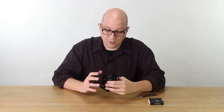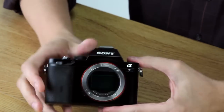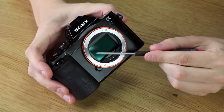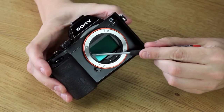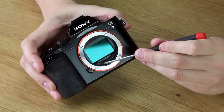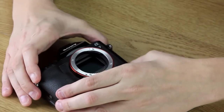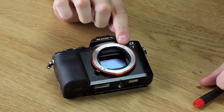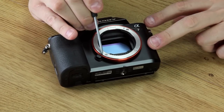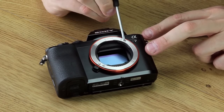So let's pull the lens right off, like so. And if you look inside, you'll actually see these black protrusions. This is what the lens locks into. They're plastic and if you've used the camera just a few times you're going to see wear in those areas already. First of all, note where the white dot is — it's at about one o'clock. Also note there's a little springy button right here. You want to be careful of it while you do the mod. But here are the four screws: one, two, three, four. That's all we're going to need to remove.